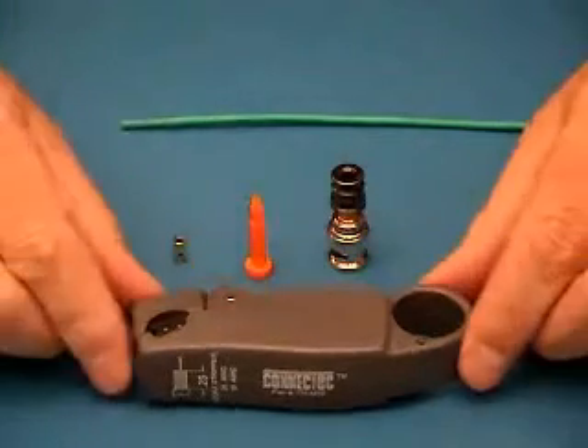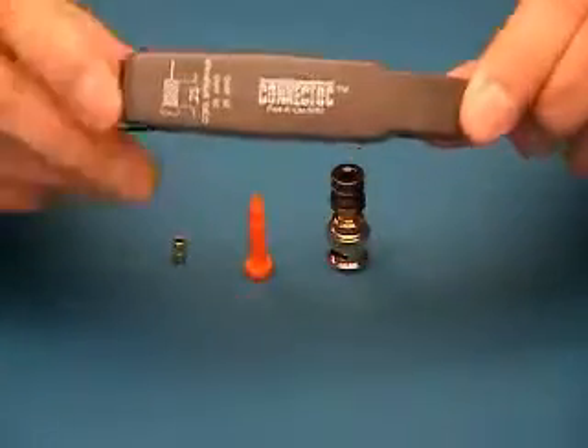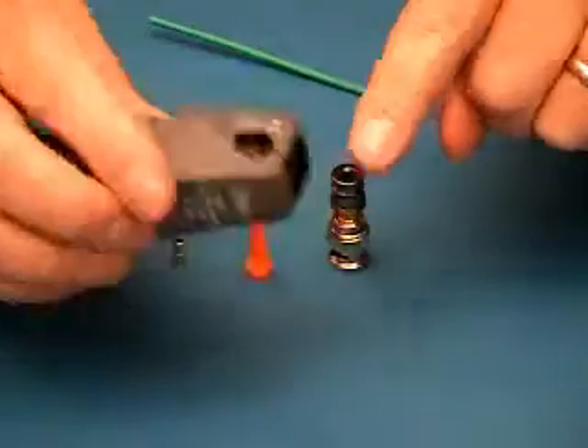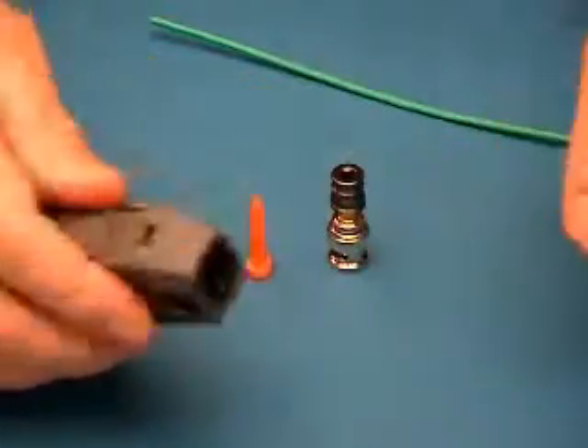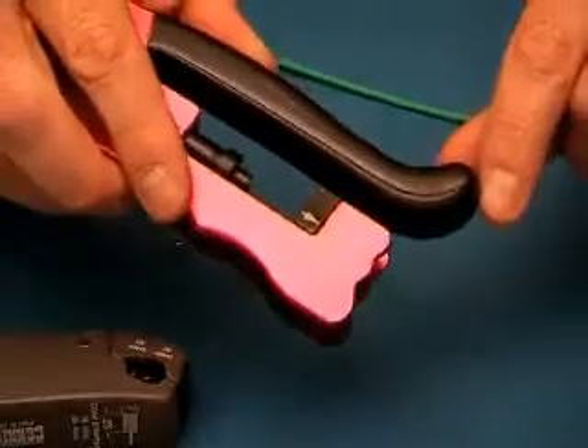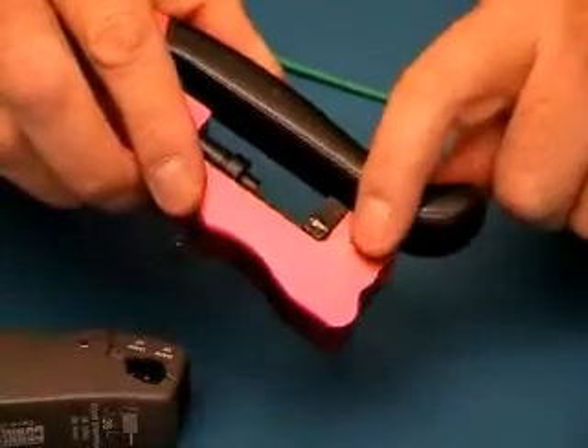You also want to make sure you have the correct tools: the CM-mini strip tool. The newest revision of this has the cavities marked with the appropriate gauge and it has a black blade holder. You also want to have the correct crimp tool, the CM-tool, and make sure your die is set up for BNC/RCA.